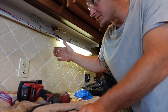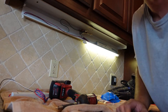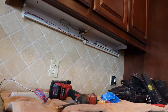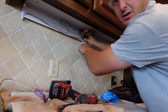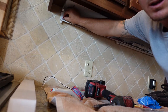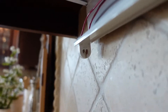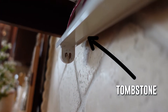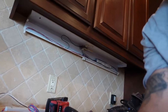The next thing we're going to do is check these tombstones to make sure we have solid connections. I'm going to shut off the power source — in this situation, that's just a switch — and give these blue wires a tug to make sure they're in there nice and tight. I'll also tug the wires tied into the tombstone side. They're nice and tight, and looking inside the tombstones, there's no huge gap and nothing is broken.